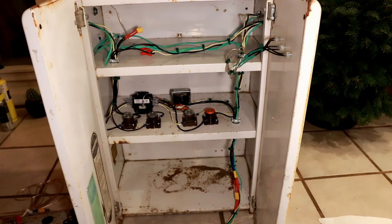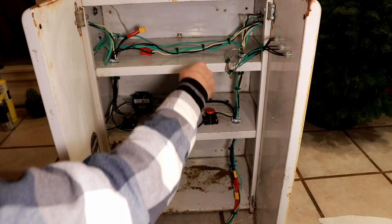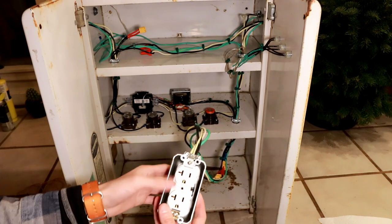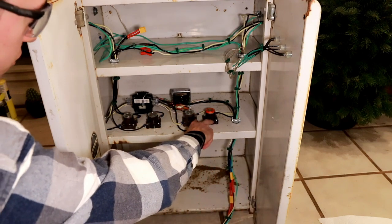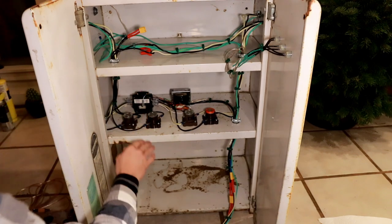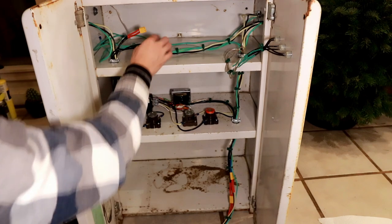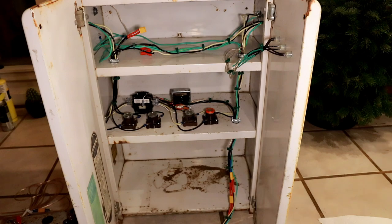I've finished wiring the cabinet. The supply cable — connecting via an XT60 connector — and the compressor connections via speaker wire are not yet connected, but everything else is tied together. Front panel lights are wired, grounds are run to the ground point, and the transformer coupling is connected via two XT60 connectors for easy removal. All fuses — both 120 volt and 240 volt — are wired, the contactor is completely wired, and the step-down transformer is wired in place. I've left a few wire nut connections for future instrumentation, and the transformer will be installed once the unit is in its final outdoor location.